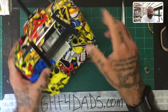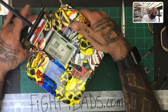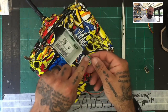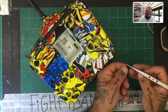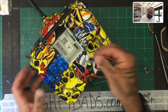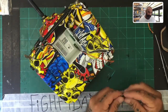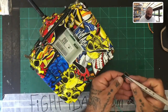So the QX7 cable won't work because when it goes in you're going to end up with ground, positive, and signal, and it needs to be opposite. You could swap them at the receiver end — like the R9 MM or R9 mini — but the risk is that you forget or make a mistake and it gets all screwed up. So I'm going to go ahead and swap the pins in the cable itself.